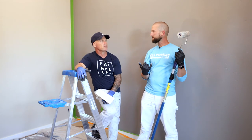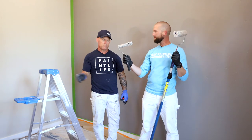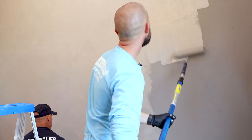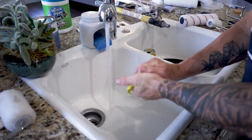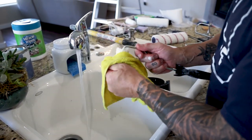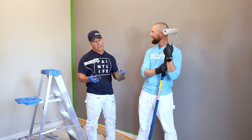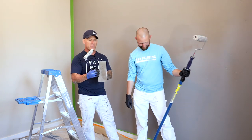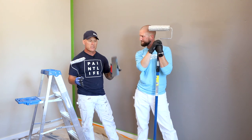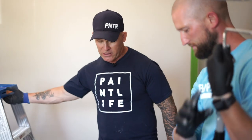We're working as a team of two. Chris is going to have the trowel and I'm going to have a six-inch microfiber roller — I'll be getting the paint up on the wall and he'll do the gritty magic. Make sure you pre-wet your microfiber rollers. Chris will be using a trowel somewhere between six and ten inches — these are flex trowels designed specifically for these products, so I highly recommend using the Boero flex trowel with the Boero metallic grit.